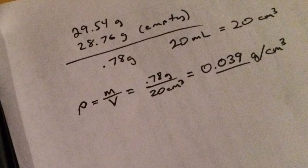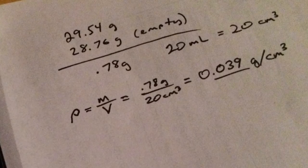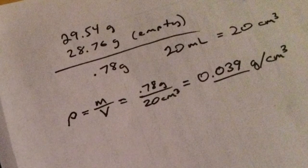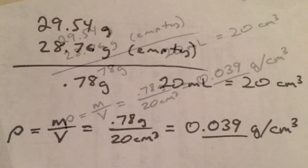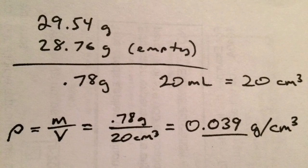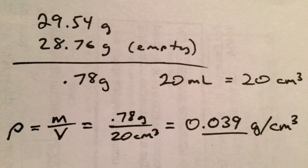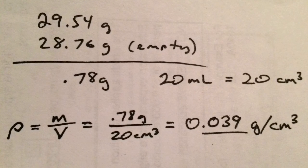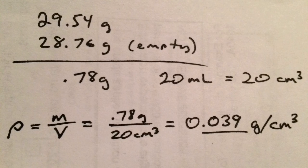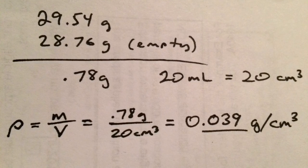The original expanded graphite was closer to 17 thousandths of a gram per cubic centimeter. So you can see that the graphite had broken down into smaller pieces to occupy a smaller volume — that's actually a good indication. Now, it didn't completely break down altogether, which I think is because the microwave energy kind of fused some of the graphene sheets together. So that's a problem I'm going to have to work on.